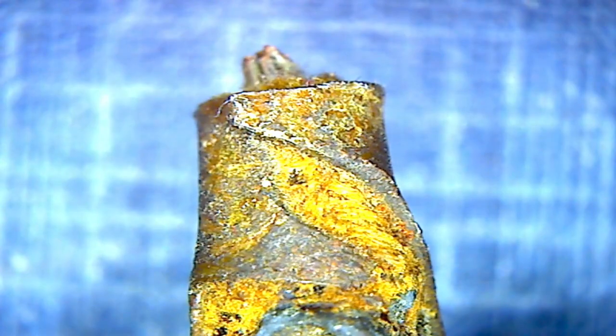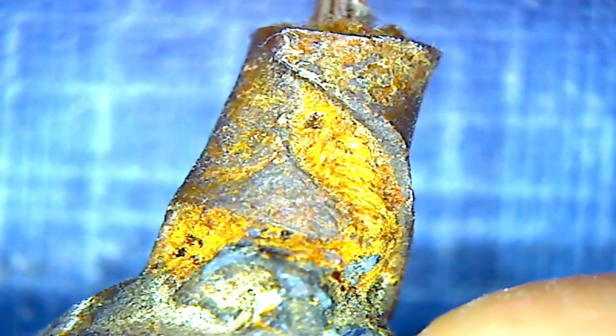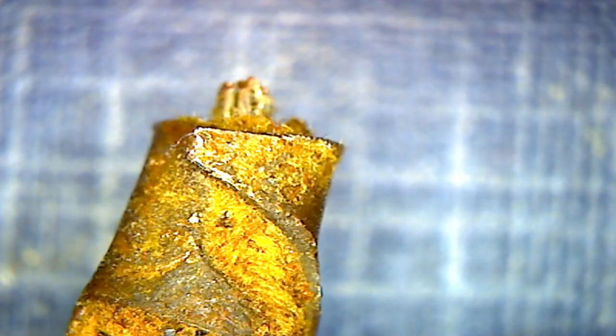And then we have this, the squeeze down part. My understanding is that this part is the actual connection, and there is no solder, but we certainly see solder on this one. You could potentially pry those back open because they're not soldered in any way. That looks like it's clamped down on the insulation. This isn't done the way I've seen others. They've clamped the whole wire insulation here, and then they brought the conductor up and soldered it in. Why can't I do that? So I'm going to try to pick this thing apart, stick a new wire right in it, solder it up properly.